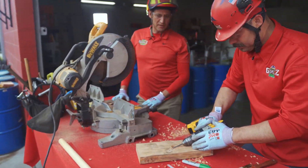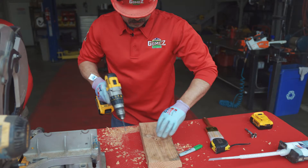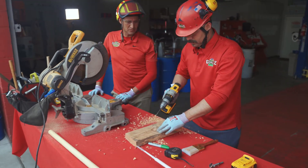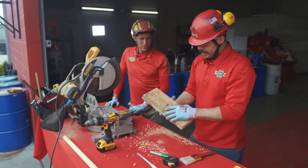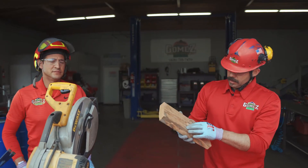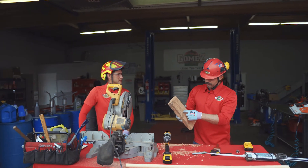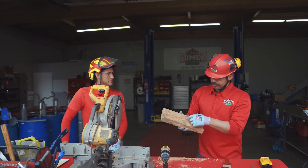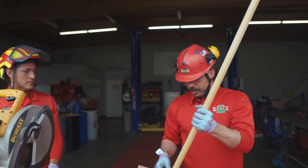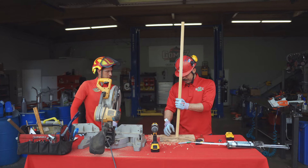I see you're releasing tension in the wood — it's like you created a chimney. Exactly. What I did there is I drilled a hole on each side of this auger bit hole, and when I press my rod into the wood, you're going to allow the air to push through the holes, and your epoxy is going to lock everything in place.